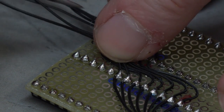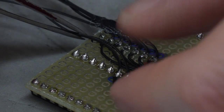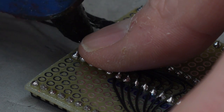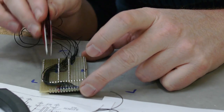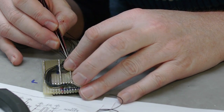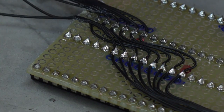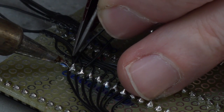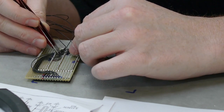I want to keep these wires away from this pin because this is a power pin. So I might glue these right like that just to have a little bit of separation, but the wires are still in order. That's good because then I don't have to go back and test them all. These wires haven't been connected yet because before I was just going to see how I went in the line along the bus. I think I will do a little bit of a jump here. So this is the end of the bus here, and these wires have already been used so I can thread through them safely. Now I'm adding just enough heat to cause the solder to flow. If I add too much heat, this wire that I've placed will pop up, so it's all about timing.